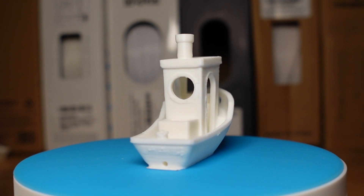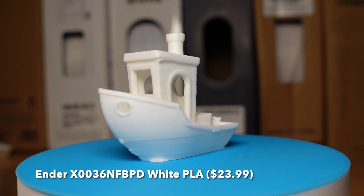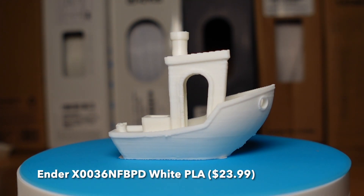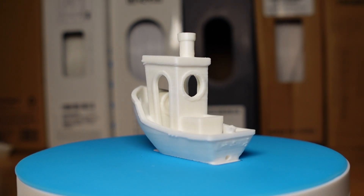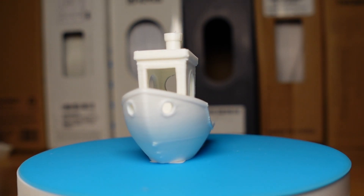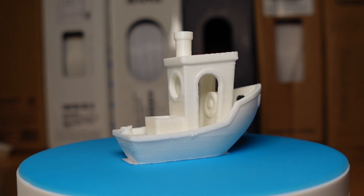As for the Ender, it's more of a true white color with maybe a little bit of yellow, but mostly a true light color. Very standard defects — nothing unusual. And that's the point: we want consistency in what we're seeing, which means the printer is being consistent. If we're going to have defects, we want the same defects in the same places, so when we tweak our slicer settings for a filament, we know we'll get a consistent resolution to those defects.